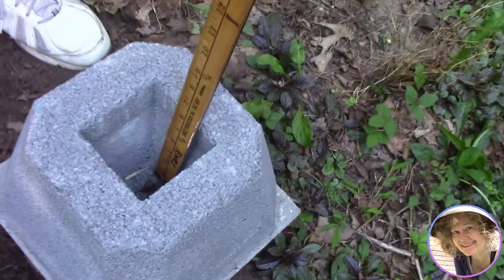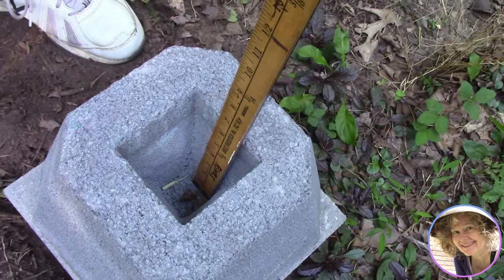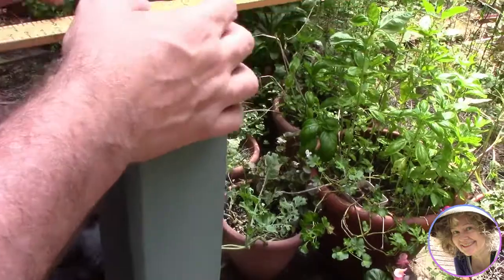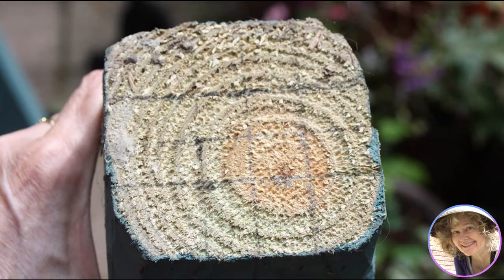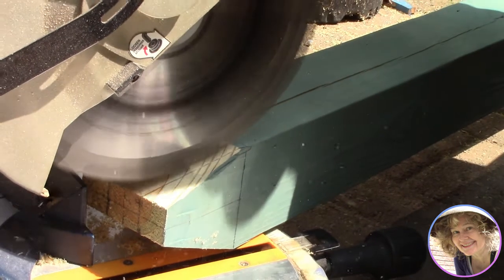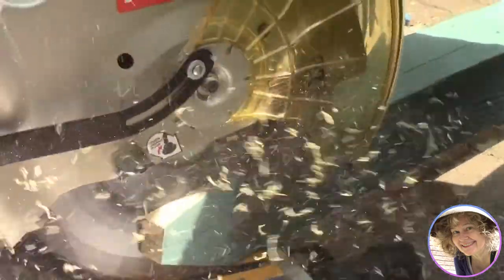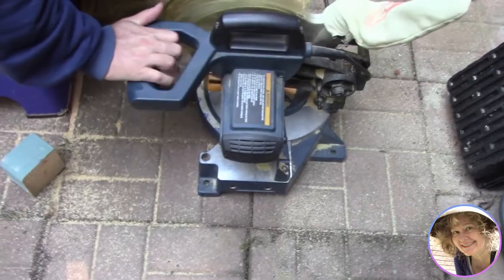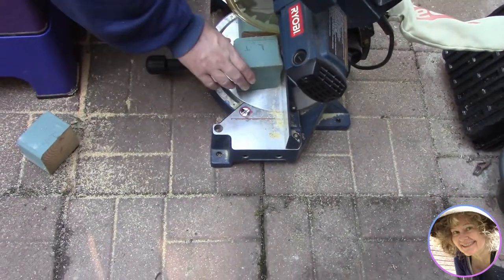It's about seven inches from the top of the block to the bottom. You could try hammering the square-ended post into it, but what we decided to do was taper the ends of the post with the miter saw. Pat measured a grid, drew lines on the bottom of the post, and chopped off each corner — this really helps the post settle in firmly into the blocks. We also shortened our posts using the miter saw so the posts accented the bridge without overwhelming it.